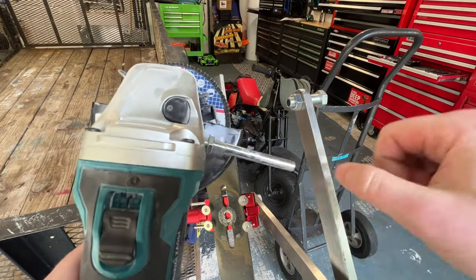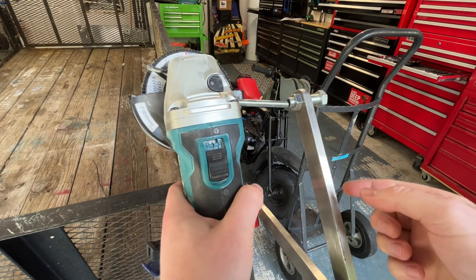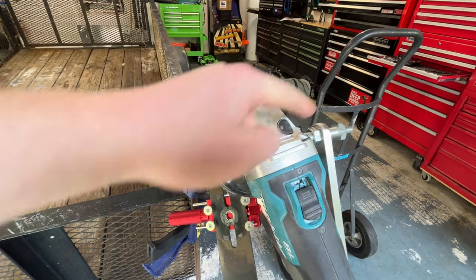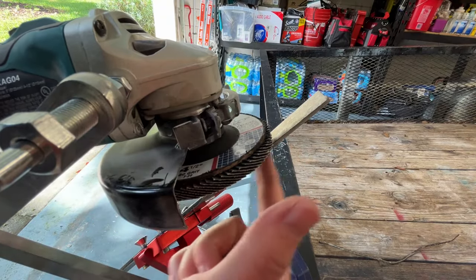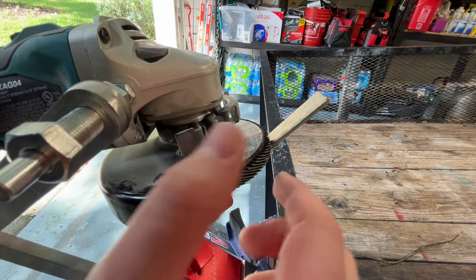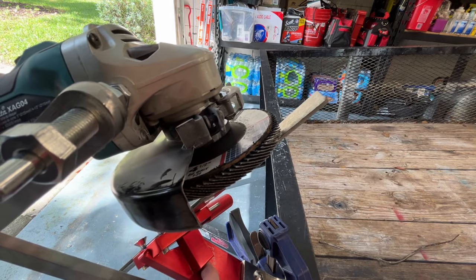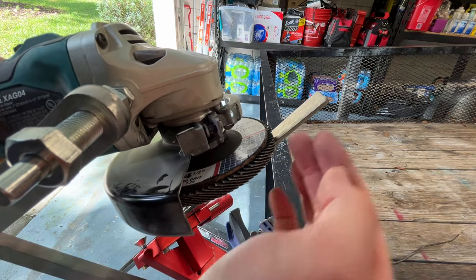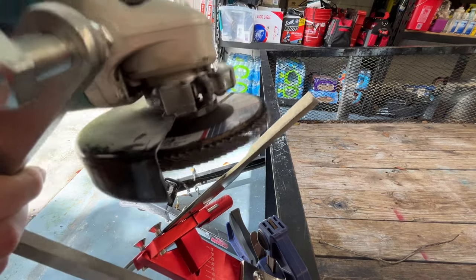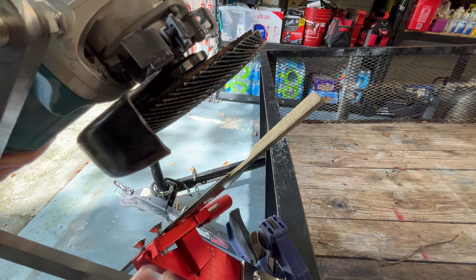Makita angle grinders are a little fussy — it's not a perfect handle straight off the angle grinder. So what you have to do is once you get this in, you then slide this pin in here to hold your grinder just like that. A little trick I like to use: you can actually put the grinder while it's still off and put it right up against there and make sure you are staying flat on the sharpened part of that blade. That's where I'm at right there at about 30 on my angle, so I know when I turn this thing on I'm going to get that nice perfect edge. The cool thing is this thing is holding my grinder for me, so when I do make that swipe there, it's not going to make a different size edge. So let's give this thing a shot and see how well it works.